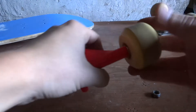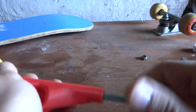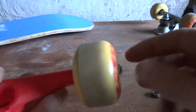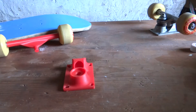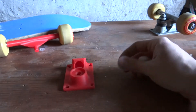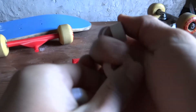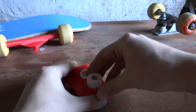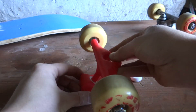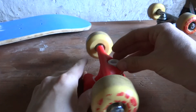Just put the rod inside this part, then two nuts — one here and one here — then the wheel and another nut. Here are all of the 3D printed parts. Here is the base and here I have 3 parts printed with TPU filament. All of them are printed with 100% infill. This part goes here, then this part goes here, then you can put this piece on like that and this one on top.